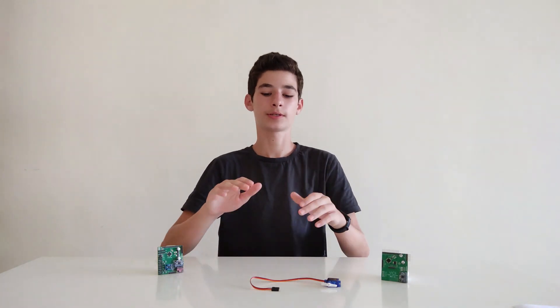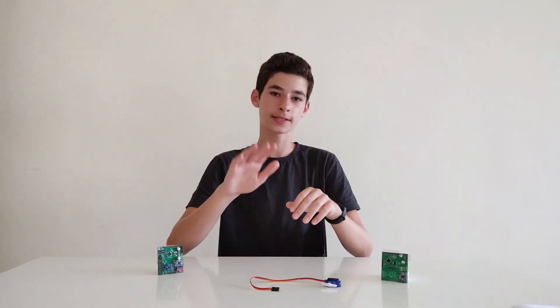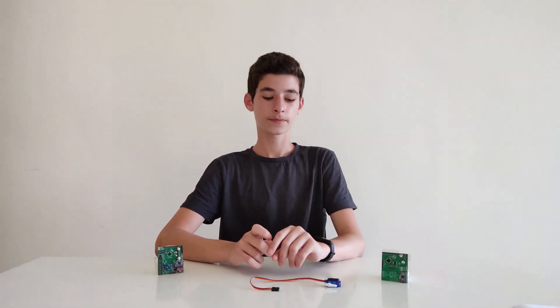This flight was successful and the airplane flew well. You may have noticed a big wiggle on the y-axis. This was caused by an over-aggressive elevator setting and it's an easy fix. To determine orientation, the flight computer uses a complementary update filter that I wrote, and it had a bug in the first two flights. After I found the bug, I fixed it and then we went for flight three.